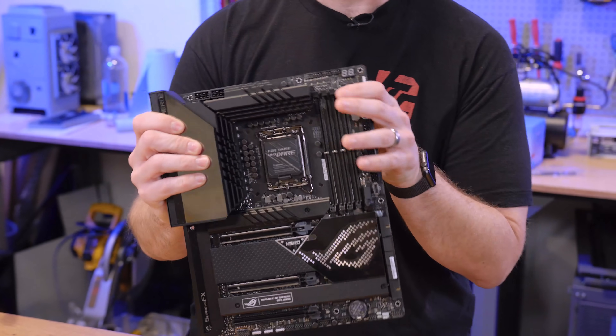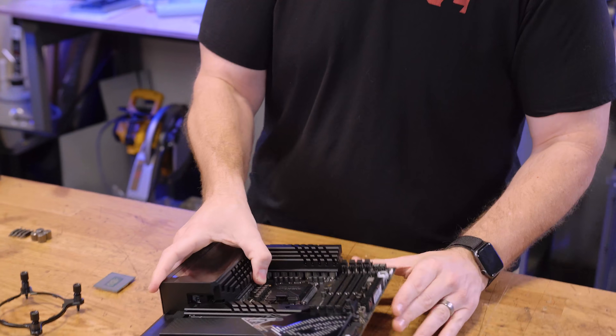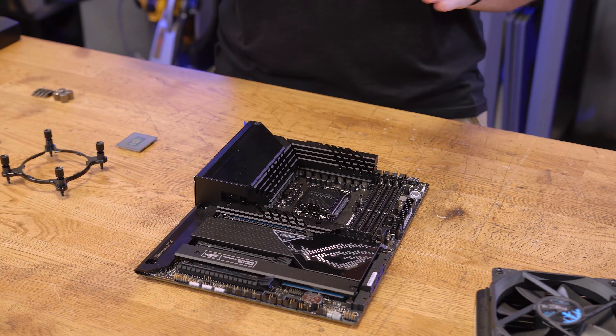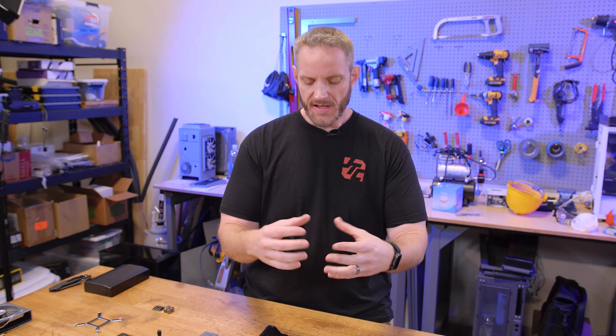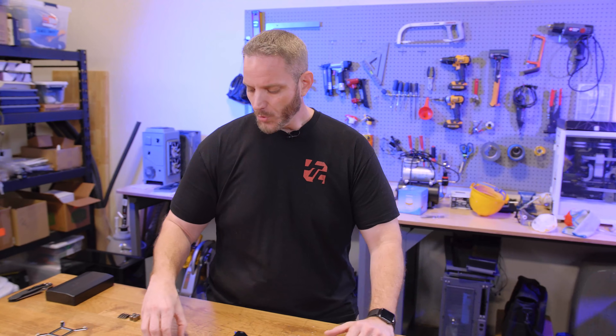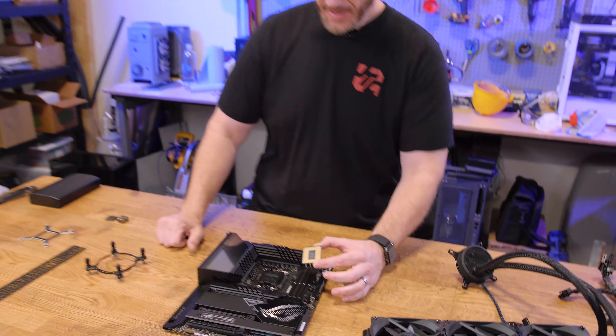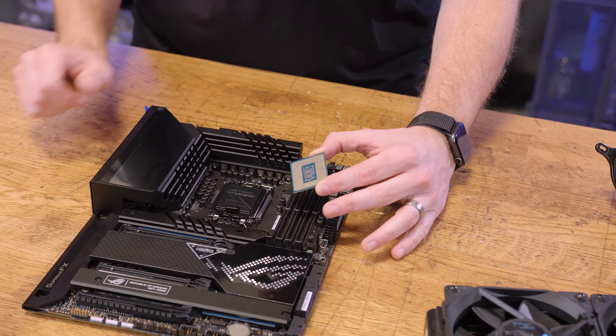Yes, we already know these boards have caught fire — we already know why, the capacitor's backwards, we talked all about it, our board's fine. But with constant socket changes, which for the most part with Intel didn't matter because it retained the same size — just the small square size of a typical Intel CPU — the only thing that changed in the previous size was the amount of pins in that array, but the overall substrate size stayed the same. Now that we have a larger substrate and more pins, 1700 of them to be exact, we no longer have this nice square thing we have to have tension on to keep cool. We now have this rectangle.